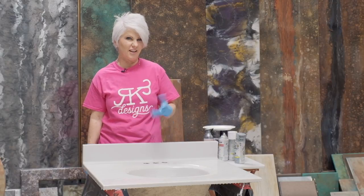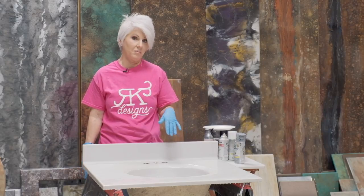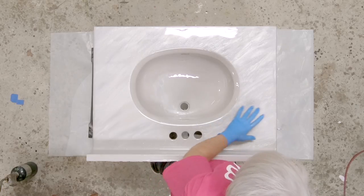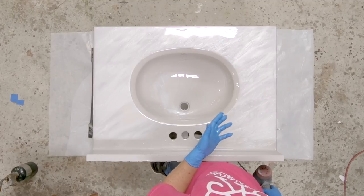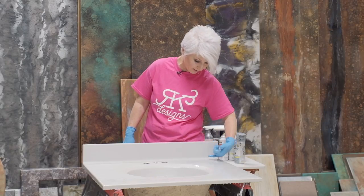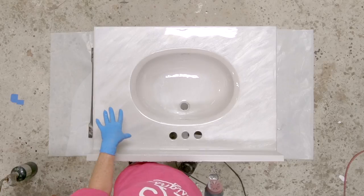It's been setting, I don't know, 15 minutes or so. This is an incredible finish on its own. You could even call this maybe a mother of pearl type of finish. I have striés in here that I did with my hand, and I like that. But if you wanted a real mother of pearl soft finish, this metallic can be made to be very soft, and I'll show you how to do it. But this area right here is very soft. You don't see a real strié pattern, and that is a gorgeous pattern, especially for a bathroom.